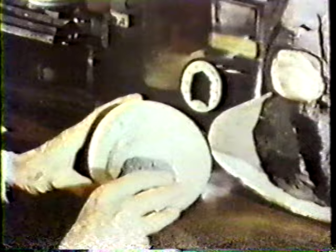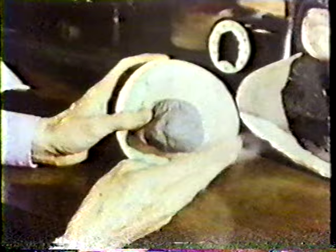So I divided this face up into about ten sections. For instance, I take off the clay from the lower lip and chin and I put it on a duplicate of Dustin's lower lip and chin — that's where I will do the final modeling of that particular section. I'll do the same thing with several other pieces of the entire face. At this point I put a rubber wall around the life mask section with its finished clay sculpture, and I pour plaster within it in order to make the mold.